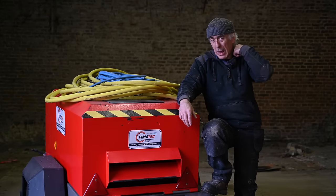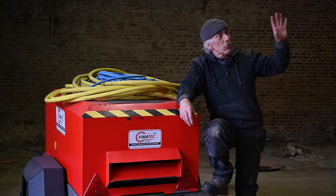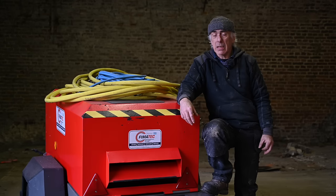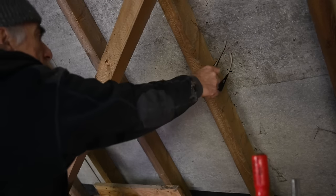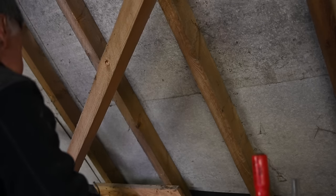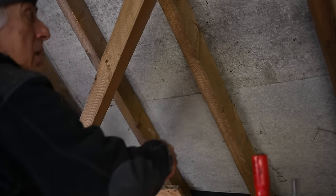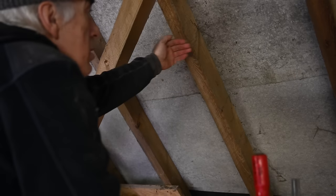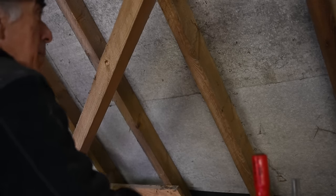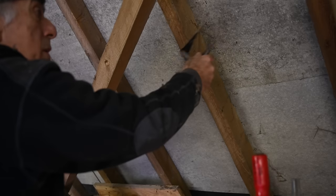Before we start I just want to answer a few comments from the previous video. One comment was that insulation on the roof might not be good if I'm not going to heat the barn — yes, absolutely right. The boards on the rafters are cement boards reinforced with fiber, not asbestos. But as you can see, these boards are breathing, and it's been raining a lot lately. You can see a little bit of humidity coming through — not wet, but humid. If I close this up with insulation panels that don't breathe, I'm going to create a cooking environment for mushrooms and the wood will probably rot. So it's much better to leave it open so it can breathe and dry out.